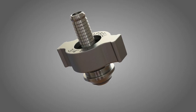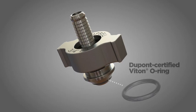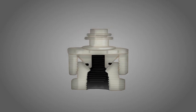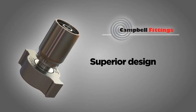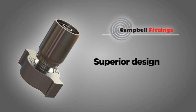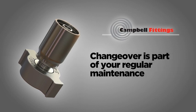The best steam hose coupling is Campbell Fittings' Viton seal ground joint coupling. The Campbell coupling design is similar to a JIC hydraulic connection — the stem and spud have a flat face metal-to-metal seal, plus there's a Viton O-ring on the stem which acts as a secondary seal. This allows the coupling to be tightened only by hand for a leak-free connection. Hand-tightened — no whacking with hammers, no leaks. And even though the design is an improvement over old-fashioned couplings, they will still interchange with them, making a changeover simply part of your standard hose maintenance program.